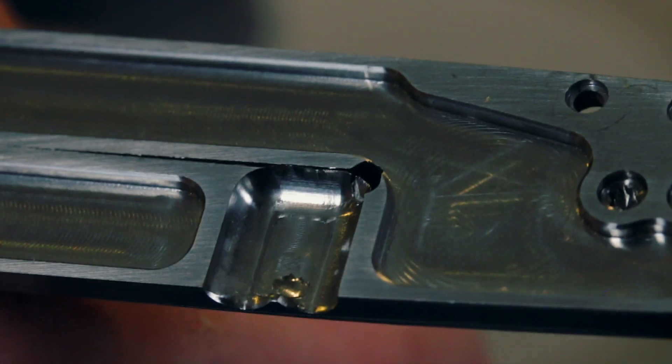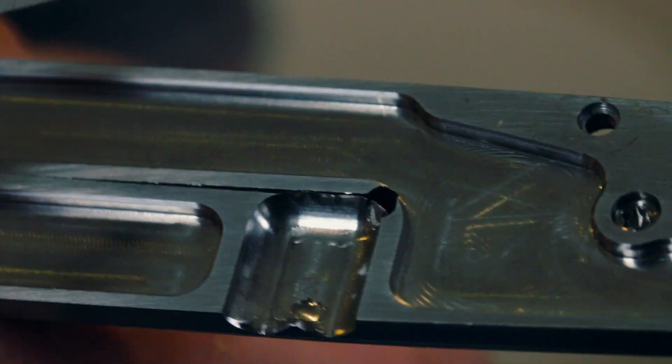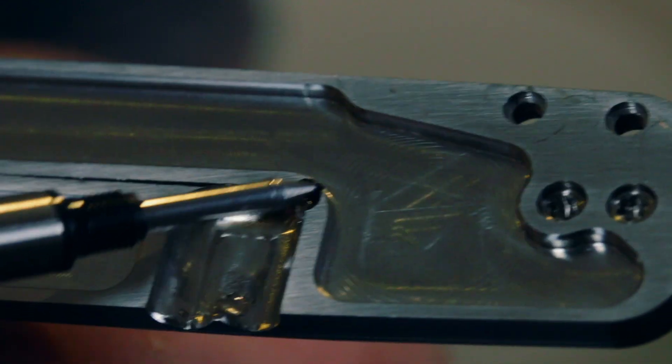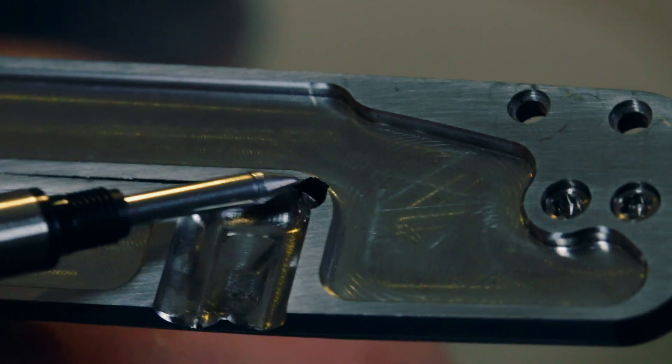Issue three is this water jet cut line here. It comes all the way up — I water jet cut it while it's in blank form before machining. If you don't put a circle at the end of the cut, the metal will fatigue and crack. So you put a circle there — it probably has some technical term I don't know — but it just relieves the stress and stops the scale from cracking.